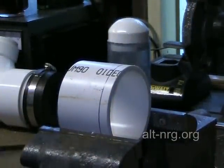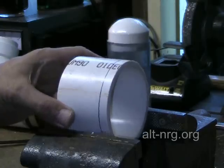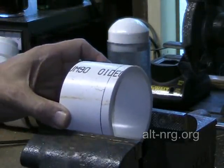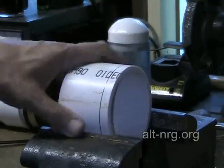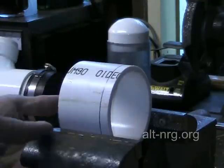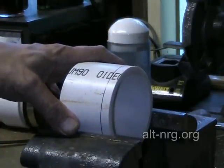I'm over at my vice now. I've got the vice jaws open just far enough so that the pipe will sit in there without spinning around and is held very stable by the size of the opening. If I was to open this up one more turn, the pipe would fall right down through the jaws — that's how close I am to this just falling through.